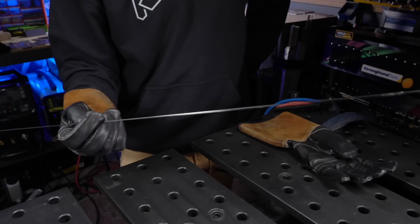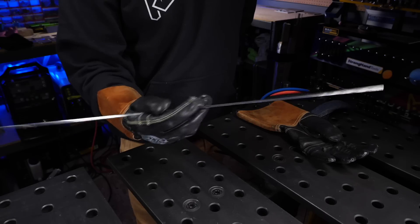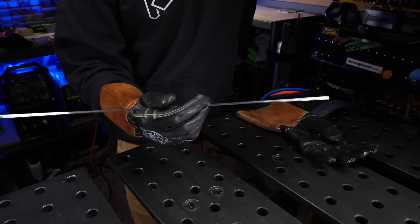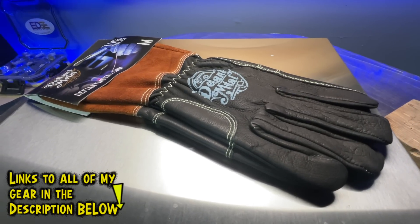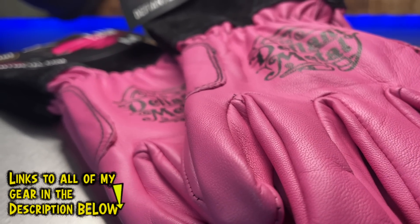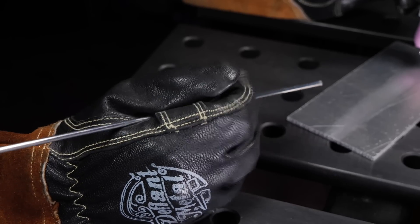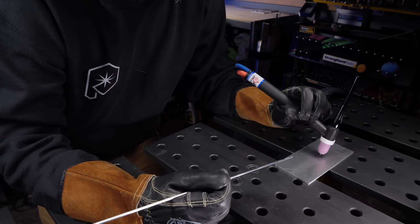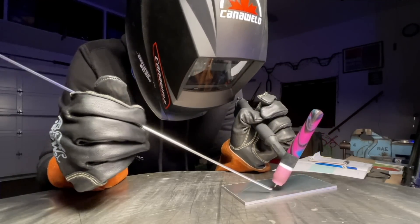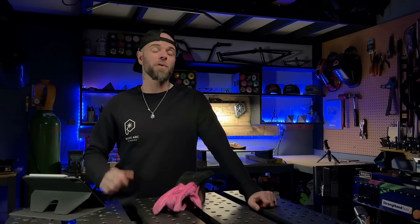I find a lot of people have a little more trouble learning with a filler rod when the diameter is a little thinner because the material is a little more flimsy. This is why when working with aluminum, I prefer to work with 1/8 inch or 3.2 millimeters — it's going to feel a little more solid in your hand. Essentially, you're going to feel it in your hand more. When you're learning, you definitely want the best dexterity you can get, so using a diameter with a little more weight to it, you'll be able to feel it better. Even if you're just using a bigger diameter to learn how to feed properly, that's totally fine. I really recommend learning this first. So if you are running dry passes with the torch over a joint and you can't effectively chase it with your filler material, you should get more comfortable with this before running any longer passes.